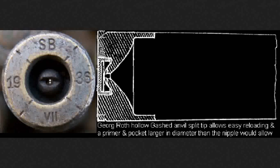This also meant you could pop out the now center hole primer by pushing that with a simple pin, which you could put on a, I don't know, metal dowel or wrap it with paper or whatever, so you get it centered every time, pop out the primer and put a new one in. And it required nothing more than you take a standard anviled primer pocket, drill a hole through it, and then cut a slot or an X or 3 cuts so you have 6 sides. So the gases from out here don't have to go through a hole. They go into the center.